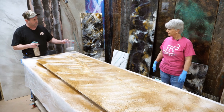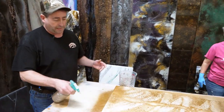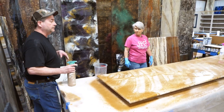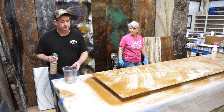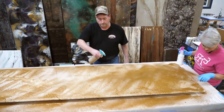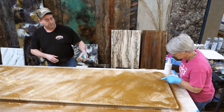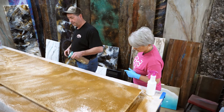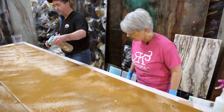For your edges — because it's a liquid, it's going to run off. So on a kitchen counter that's an inch and a half thick, you're going to have to probably come back and touch it up because it's just going to run. Now this looks really cool — it's starting to do it already. It's a reaction between the epoxy and the dispersions that causes the crackle effect.